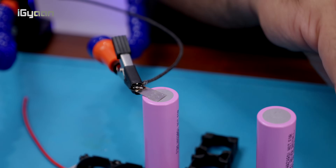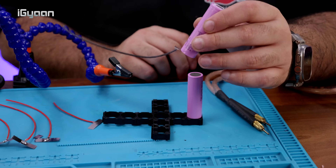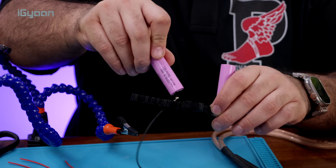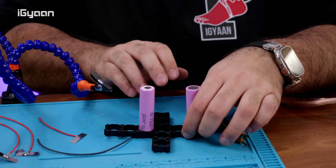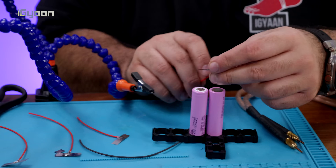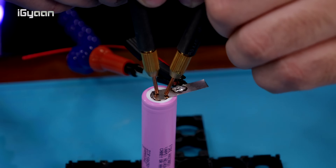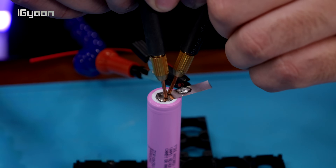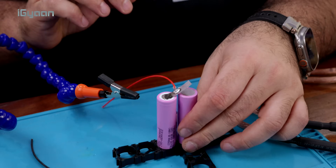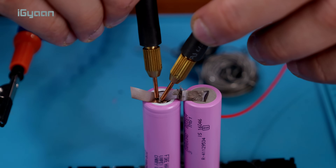Weld directly onto the battery — you want to do this in a well-ventilated, safe environment. That's the first connection, and now I need to connect the other strip. I'll pass this through and connect the battery pack, then bring the second cable — connecting between these two — and using the foot pedal create these welds. These are nice and clean welds. Then you connect the positive to the negative in a single line, folding the nickel strips as well.